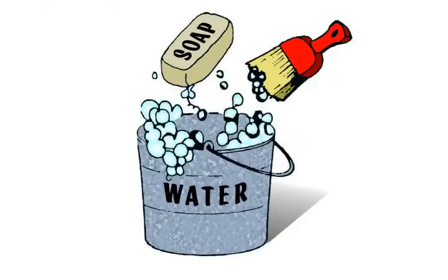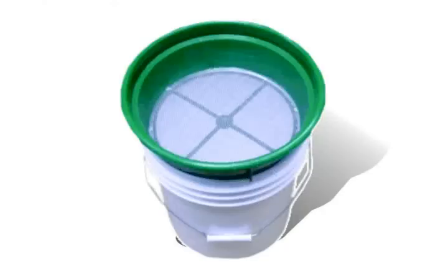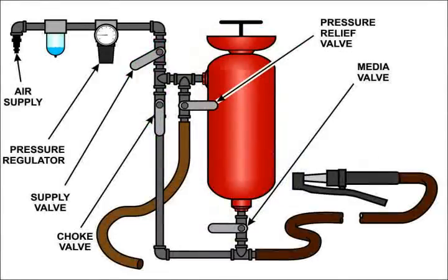If your pot is new it will most likely be shipped with a coating of machinist oil to keep it from rusting. Add your media, being sure to strain it through a screen to remove any foreign debris. Sieves made to fit a 5-gallon bucket with precise mesh sizes for different media can be purchased, but a piece of window screen will usually do the job. Connect your air supply and check the regulator for pressure by looking at the gauge, or by gently cracking open the supply valve and listening at the top of the pot. Stick your hand in the air flow from the top of the pot to get a feel for the air flow.